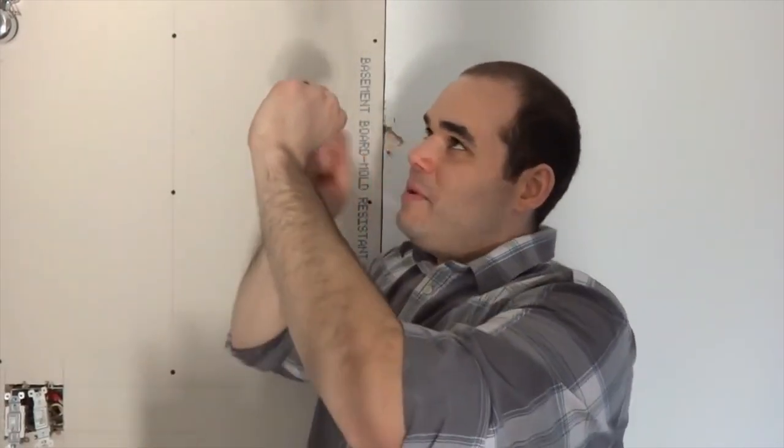Now when we did the ceilings in our house, we put up board and batten ceilings, we covered up old popcorn ceilings. So we kind of used a similar method to how I showed in the first one. We took a nail and we just popped it in where we kind of thought one would be, and we popped it about every half inch till we found a stud. Then we measured over, it ended up being every 16 inches. So then we were able to mark that way.